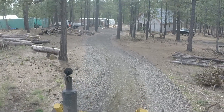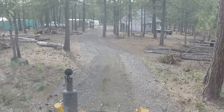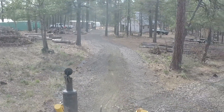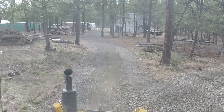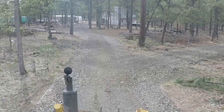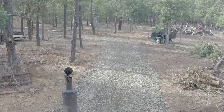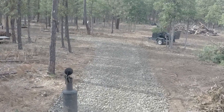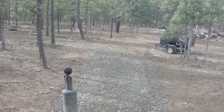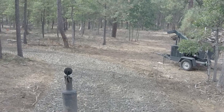The gravel company is coming back out with a full load of inch-and-a-quarter minus. I'm going to backfill around my house with some dirt to build it up a little because it's low, and then put inch-and-a-quarter minus around the house. That's going to keep the area around the house from turning into mud from snow and rain coming off the roof, so we're not tracking so much mud into the house this winter. Eventually next spring or summer I'll pour nice concrete walkways around the house and patios on the ends, but I just don't have the time to do that this fall.